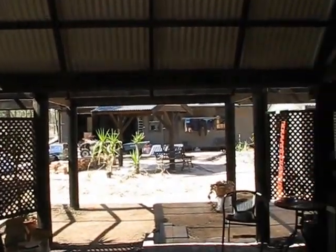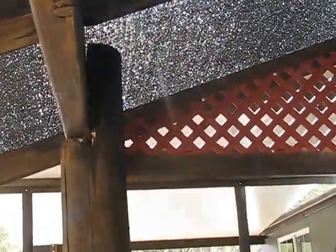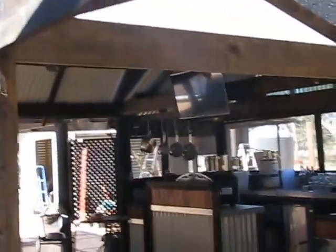But I use chainsaw technology when I do things like rebates. I've got a couple of rebates. I'll focus on one over here. There we go. There's a rebate. That means the beam is rebated into the pole. I set that level from a nail that I set down low, measured up to get the level, so that the pole is level at that cut point with everything else around the building. Those levels are set by a laser.